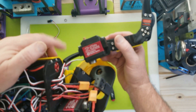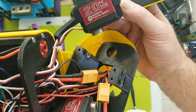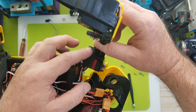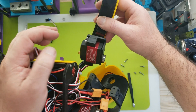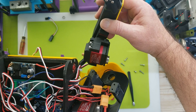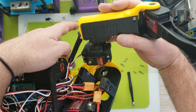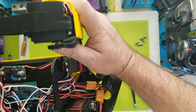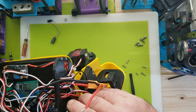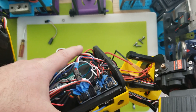You can see I've wire-tied and screwed a little hole into the framework to hold the wires out of the way. The only motor with potential issues is this coax movement — when she moves her arm up, you can potentially pinch those wires between the motor and her shoulder. I put the wire ties there to keep that from happening. Actually, this is not the motor we're replacing — I'm on the wrong side — so I'll let that one hang since it's wire-tied. This is the one we want to give surgery to. Let's flip her over carefully.